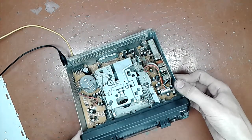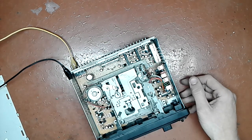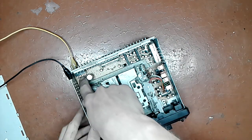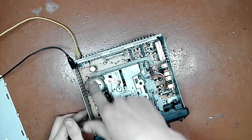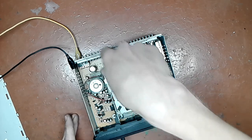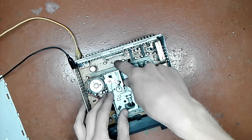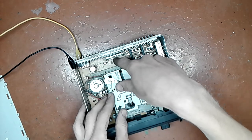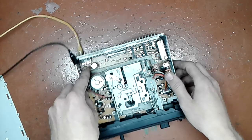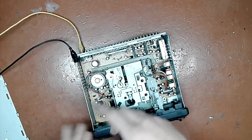So I turn it off. I go get a test speaker, and figure out where to connect the test speaker as well. You look at the silk screen on the other side, and if not, you take your time, find the datasheet for the power amplifier, and search for what is the output pin of that particular amplifier, and then trace those outputs to the connector and connect there.